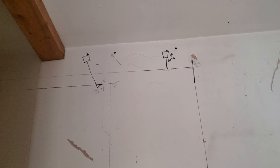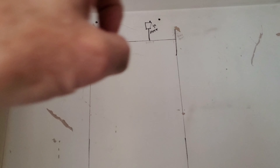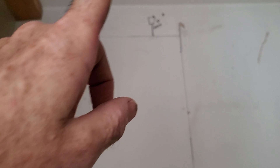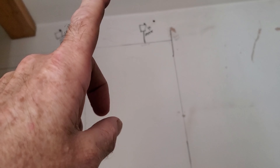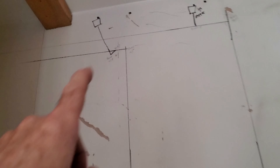Because I'm going up higher than the radiator, I'm going to get air in the pipes. I've been looking at these valves — they go into the attic and have to be about a foot of pipe or something. That's the highest bit of my attic. The automatic air release valve — air is going to rise up, that's going to be the highest pipe. So I'll run them through the attic and put a wee T joint in that, so I'm going to put two on.